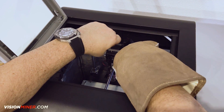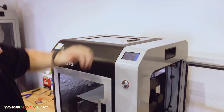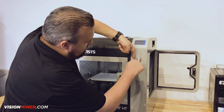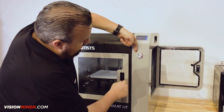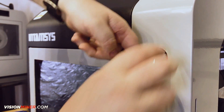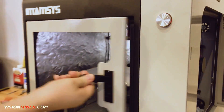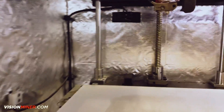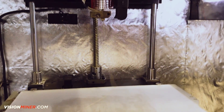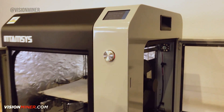There it comes, I feel it. Go ahead, push the white tube in. We can close this and now move on over to the extruder itself. Imagine that this is the extruder wheel gripping the filament — if you turn it counter-clockwise, it's going to move that filament down, and as you can see it's already starting to ooze out. Feed some more — perfect. And that's it guys, we have primed the nozzle.